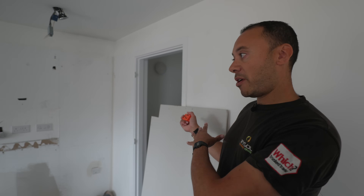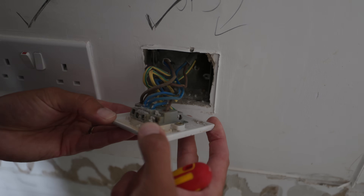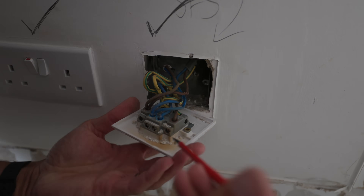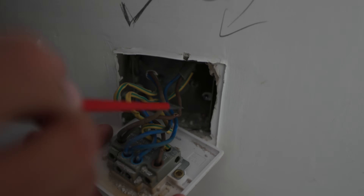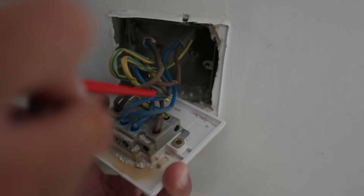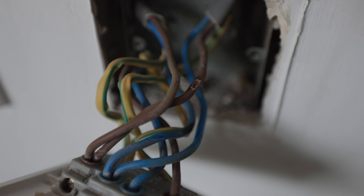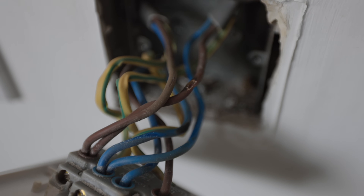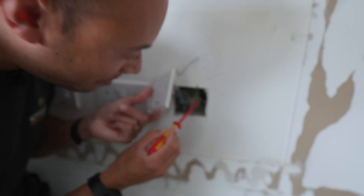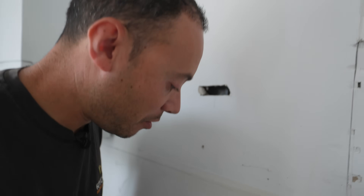This is so important to do at this stage. Oh — there is a real good reason why we're getting a bad reading. Look at this — see the darkened plastic here? Check that out. You can see the scorch marks on this neutral cable right here, and look at this cable — it's scuffed and snagged. That's bare copper there, that's bare live cable. And look at the scorch mark in the back of that box — that's gone bang at some point in the past.